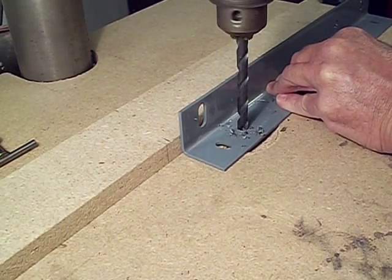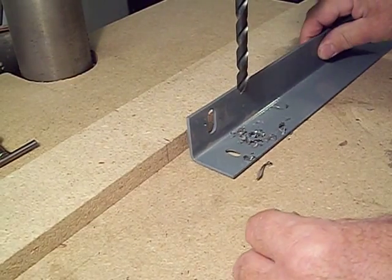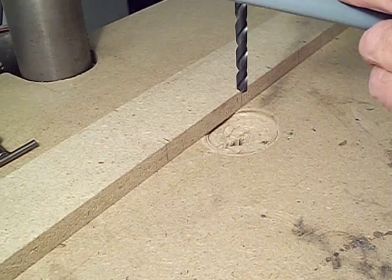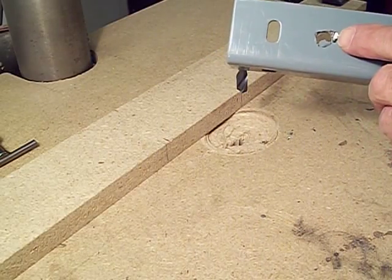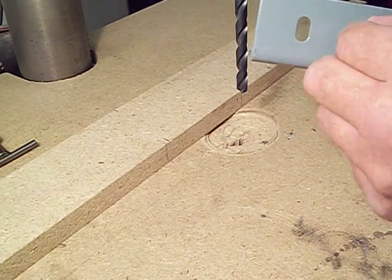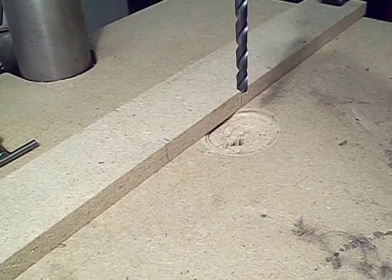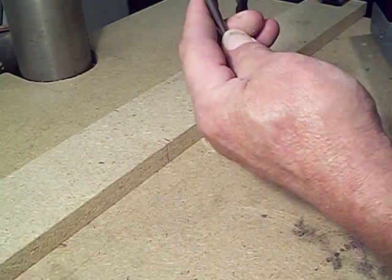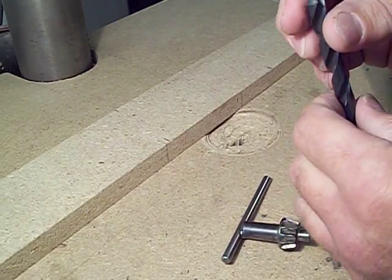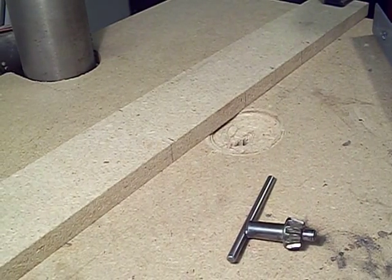Start the drill press and watch the chips as they come out. And that's not bad — that's pretty good, even with the nasty edge that we showed you just a second ago. But take a look right there. Most of the time when you drill metal, you're always going to have some kind of a nasty little outcropping of the metal where it's ragged and jagged and nasty. So I'm going to take the bit out, go over to the jig which is right around the backside of this wall, and I'll be back in just a moment. You'll hear the machine start up.